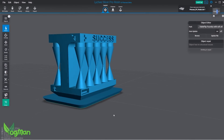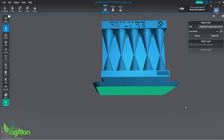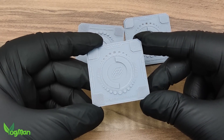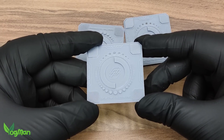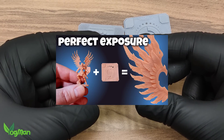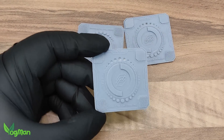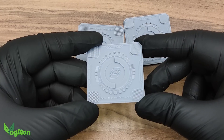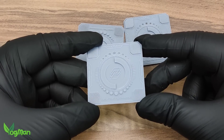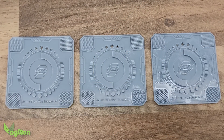The real question is, should you dial in your resin using the cones? Is this the perfect method? For me, I'd have to say no. I still maintain that the best method to dial in the perfect exposure settings is that which I've previously described in another video, so I won't repeat myself now. But put very simply, these take about 10 minutes to print. These take about 40 minutes to print. That means I can produce 4 of these for every one of these. And that could very easily be enough, especially as your experience grows.